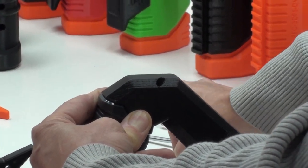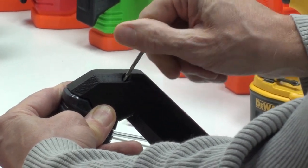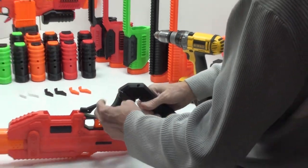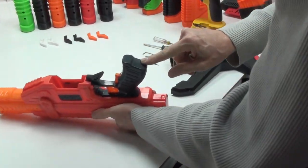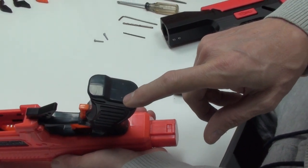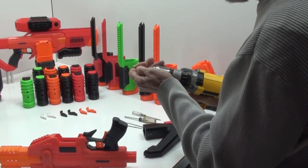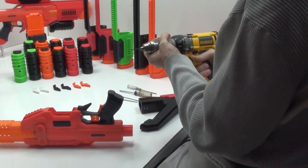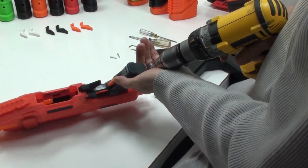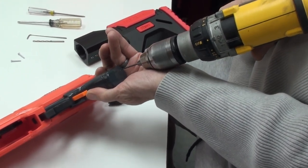When we mark it to put the holes in for the screws, we want to make sure that's aligned center. We're using a 1/8 drill bit — just take that down and turn it a little bit with your fingers on both sides. What that does is it leaves a little indent in the plastic for us to drill them. You can see the marks right there. They should be even — the same distance from the split line to the mark on each side, otherwise your stock is going to be offset. Then we take a 5/64 drill bit and drill those marks to make a hole for each side.